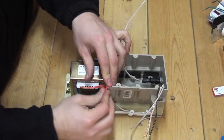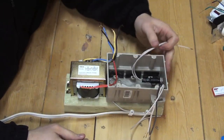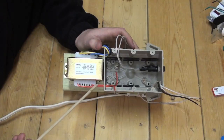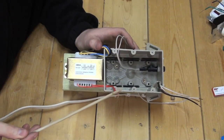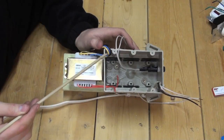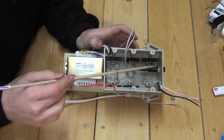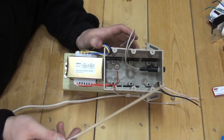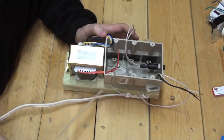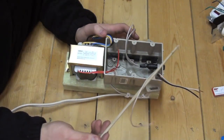With all the main wires inside of the electrical box, this is an opportune time to organize the wires into groups. Leading clockwise are the transformer wires to attach to the main service, transformer wires to attach to the double pole, double throw switch, wires from the fuse holder, and the main service wires. Not to forget the ground wire from the transformer casing leading into the main service hole.